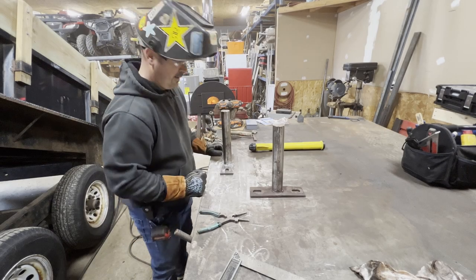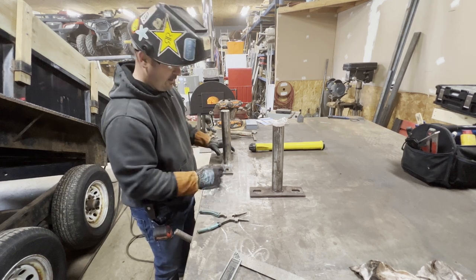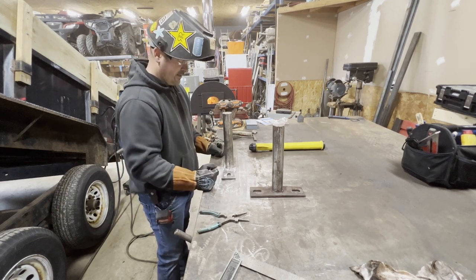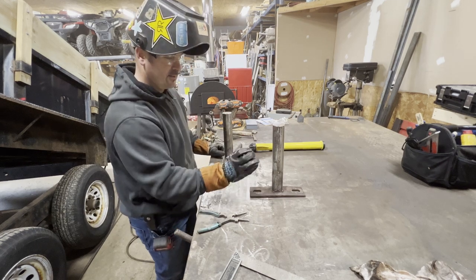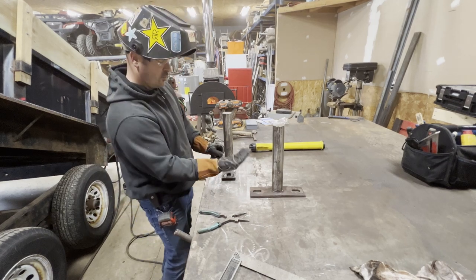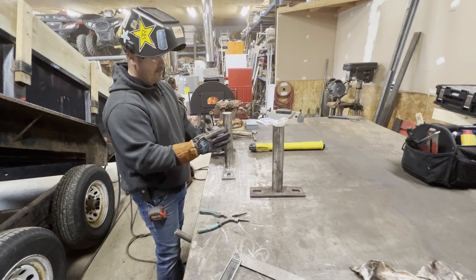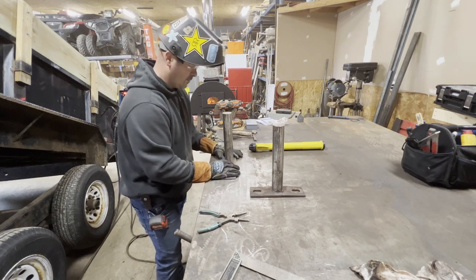Okay, so we're going to go ahead and tack the 2-inch shaft onto this pivoting base plate, essentially. They are all bent. There is a lot of forgiveness in them, given that the slots of the plate can slide back and forth for alignment, as long as we're not tweaked too bad this way, and obviously real bad this way, but we can pound it straight after it warps anyways when we weld it.